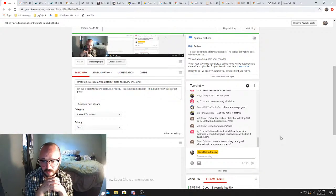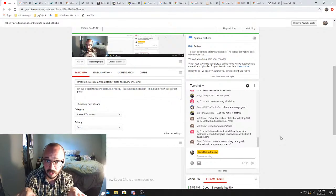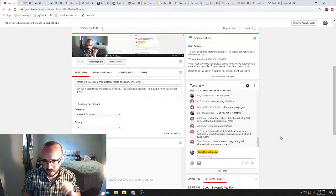I have vacuum bagging equipment. I usually keep it simple for everybody, but as we go on, I'm going to show you how to build your own equipment, kind of like my cure box, and then we will eventually get up to better composites. Because in the end, that's what we want. We want a better ratio of resin to composite fabric. We want a more even distribution of that. We want fewer air bubbles, because then you get the highest ballistic resistance, or just any impact resistance, honestly.